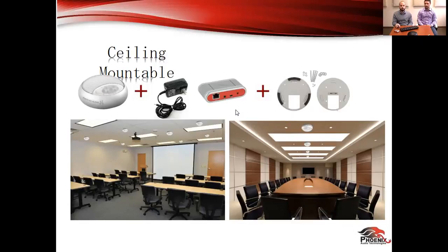Given that there are more and more USB speakerphones as this market becomes more popular, how many can you put on the ceiling? In total you can put up to 15 units — that's the limit of our daisy chaining. Through one power hub it can power up to eight, and you just add another power hub to that setup. As for who we compete with for ceiling-mounting spiders — to my awareness, I don't know of anybody else who would even suggest putting a USB speakerphone on the ceiling in any way, let alone provide a complete package of how to do it.